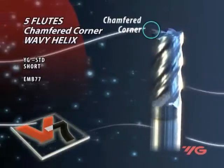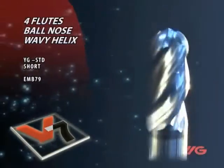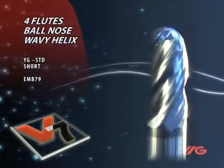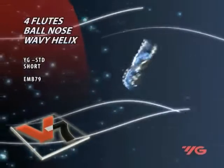V7 are applicable for machining stainless steels, precipitation hardening stainless steels, titanium alloys, high temperature alloys, cast iron, mild steels and medium tensile strength steels less than 40 hardness Rockwell C.